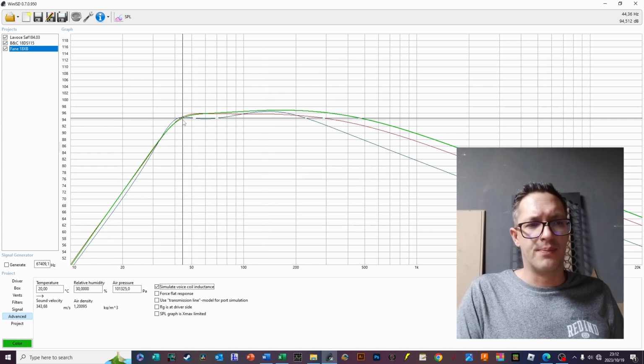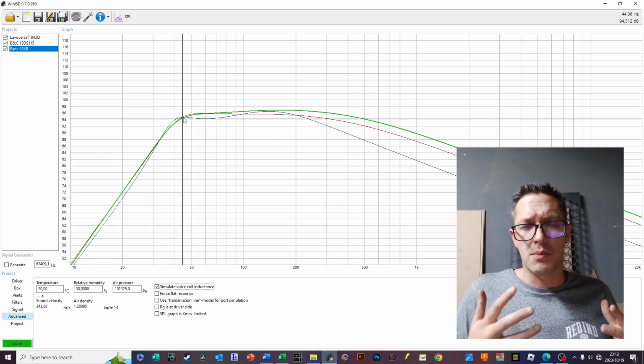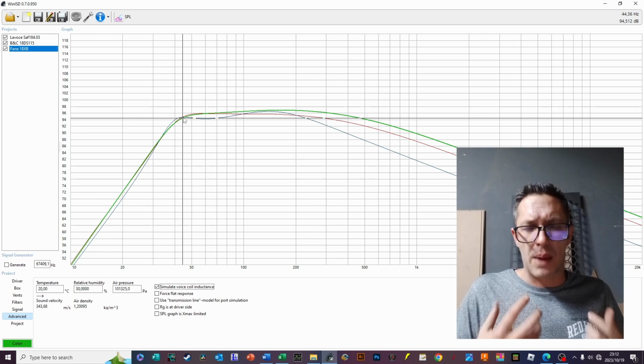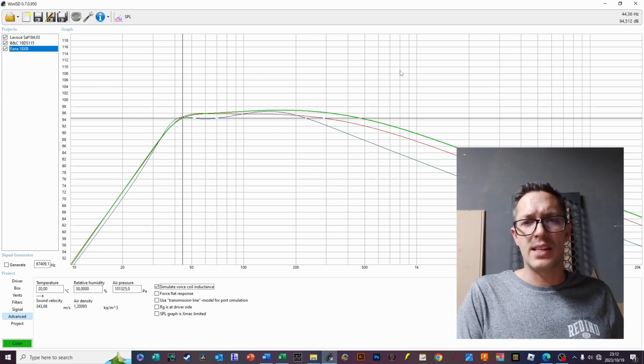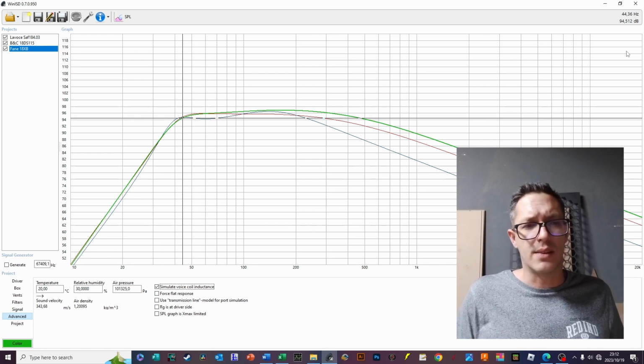They're crossing each other. Okay, so with 1 watt worth of input, all three drivers, which are very different in terms of price point, in terms of power handling and general specifications, all actually are about the same loudness. If you look in your top right hand side again, 44 hertz, call it 45 hertz, right? At 44 hertz, we are roughly 94.5 dBs for all three speakers.